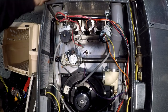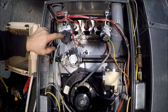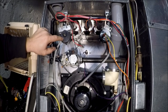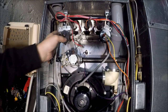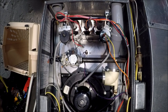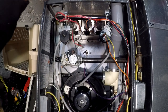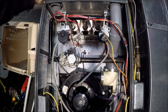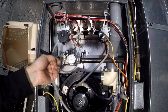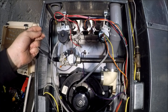Usually, if all that checks out okay, you can take a pretty good guess that your switch is going to be bad and you can order one and replace it. Now if you check all that — your drains, your exhaust plug, everything — and it all works out, you can go ahead and jump that out and run it through a cycle to warm your home up.